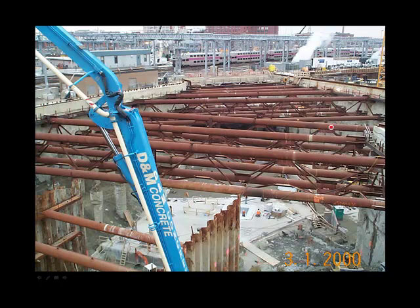That was accomplished by using only a single upper-level brace. It's not too easy to pick out in the drawing, but here's a pipe strut, here's another one, and here's a third one. These three are joined together to form a truss, and that's the only way they can span this great distance. Perhaps it's easier to see that arrangement of the three of them joined together and working as a unit, able to take a very heavy compression load at the top of the excavation.